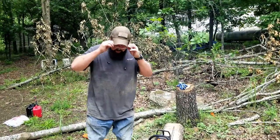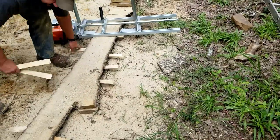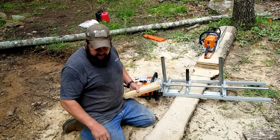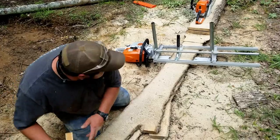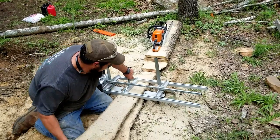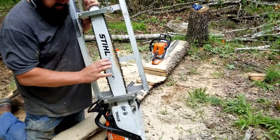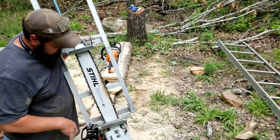So I'm going to teach you now to put these shims in, because the weight of the wood wants to pinch your blade. Every time you feel it starting to bind, it's because the weight of the wood is crushing your blade. Another thing you may have noticed is the price of wood — well, gas is still cheaper. After every two or three uses I'll flip my bar. That'll save the life of it and it'll last two or three times as long. You see how it's starting to burn? I just need to flip it again.